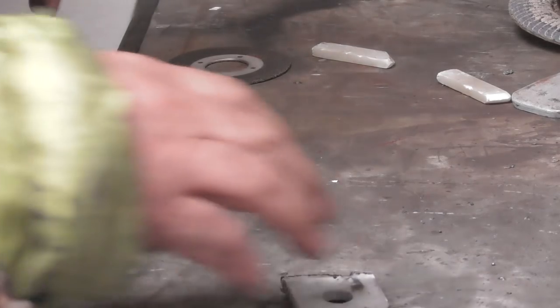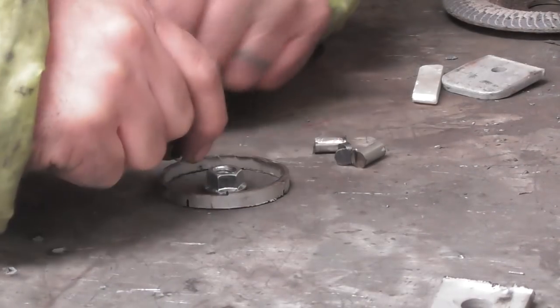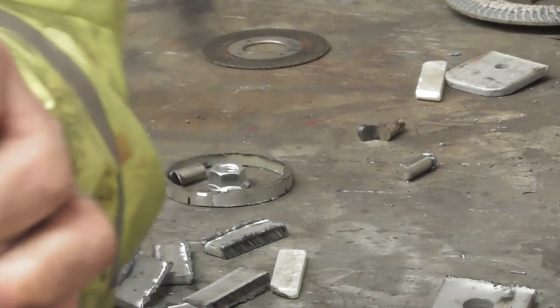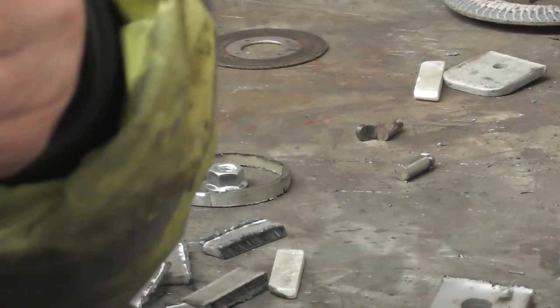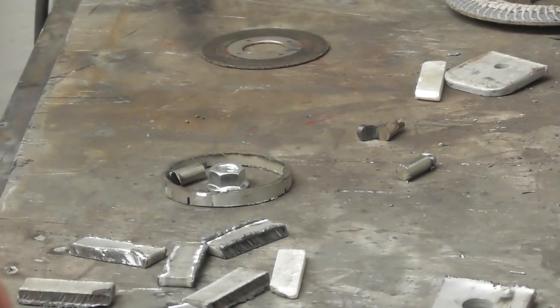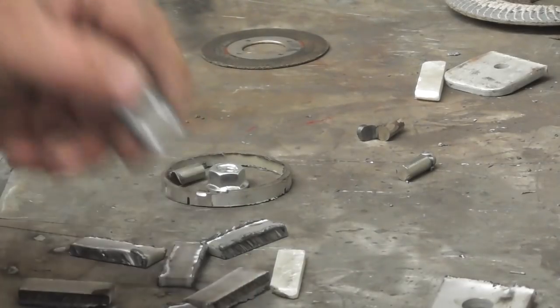Here now — I hope you didn't see that. We're hoping three of them fit in there. I just can't wait — this is the trouble. Right, let me de-slag these. If you de-slag them first — that's the only thing with the plasma, it slags you up a bit. See the slag? Just knock that off. It comes off quite easy, but it grinds off quite clean. So if you knock it off first, it's instantly a winner.